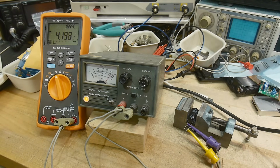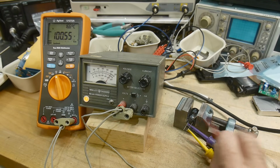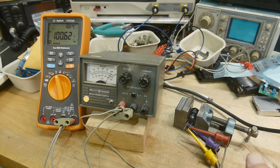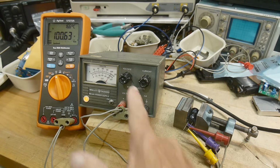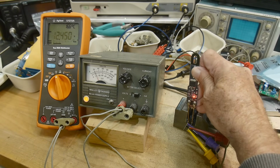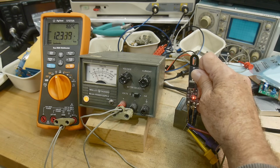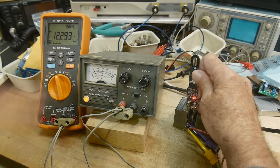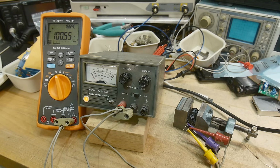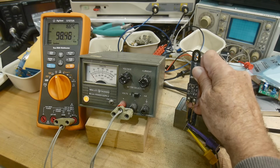The other thing that we can do is charge this thing up to 100 volts, and then let me actually put the power supply right across the capacitor, and then I'll move this over to milliamps so we can measure milliamps. And let's go ahead and put this on here. You can see the LED stays lit because we're discharging at constant current, and it looks like it's at 20 milliamps here. That's interesting. I'm not sure exactly how accurate this is. Let's try that with a different power supply. Again, we're going to take off our power supply, and we will discharge the capacitor and make it safe.